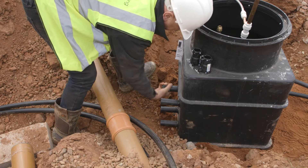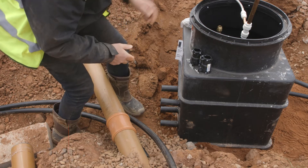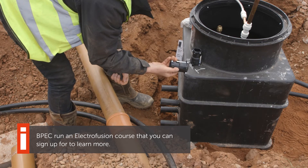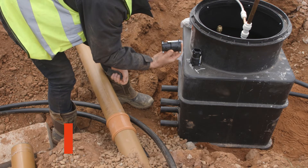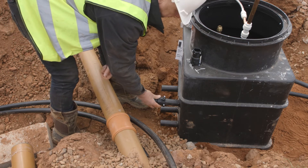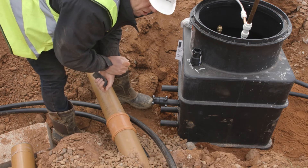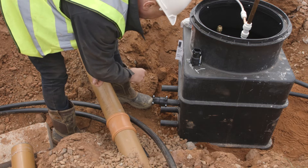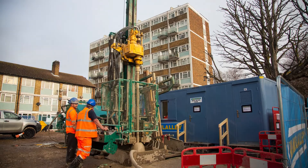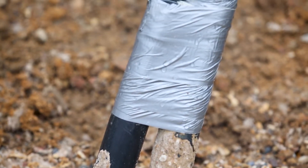If there were deep gouges in that pipe you'd have to really clean the fitting back to make sure you don't get any leaks. Everything that is buried in the ground is electrofusion welded. What we're going to use here is a 40mm by 32mm electrofusion reducer. The stubs that come with the manifold are 40mm, but the pipes in the slinkies are 32mm. The manifold is made 40mm because if you were connecting to boreholes, borehole probes are 40mm — so the same chamber works for either boreholes or slinkies, with just an adapter needed.